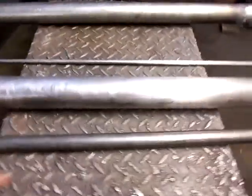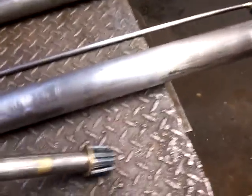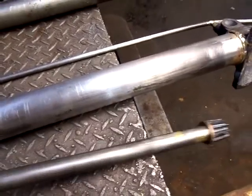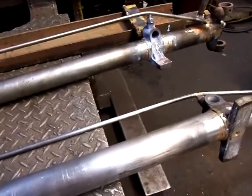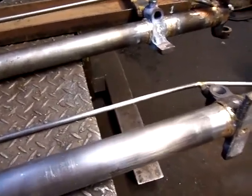This is a steering gear we just cut. It's a 10-tooth gear on a 4130 shaft. Same with the two axles — the new ones have 4130 tubing. Same way with the draw rod.